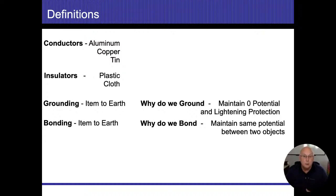Now, here in the state of Illinois, it should be known that we do have mandatory defects that we have to report to our clients. There's only five of them, but one of those five is solid aluminum branch circuits.